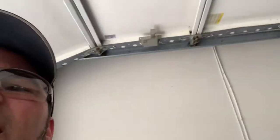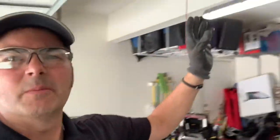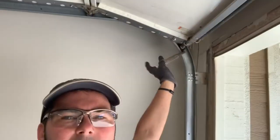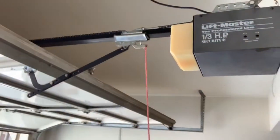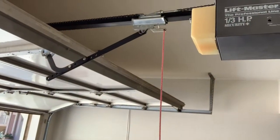That's what we need. Without it, you are in trouble. It's actually sometimes harder to let down the door if you do it the wrong way than it is to open it, even with all that strength required. Now the last part: since I have the vice grips in place and they're firm, all I need to do is give a tiny tug and it should move just a tiny bit.